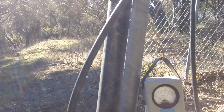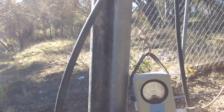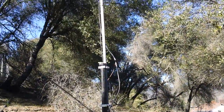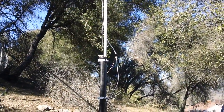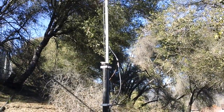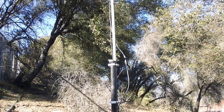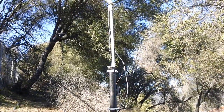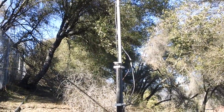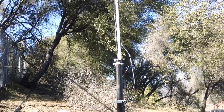The rule of thumb is: get the biggest, best cable you can with the shortest distance you feel comfortable running. I'm comfortable with this setup right here. Those losses I just showed you — from five watts down to three watts — that ratio applies to even higher wattages. So if you've got 50 watts pumped into this, you're going to lose 18 to 20 watts out of your transmitter. It's a ratio thing, and it translates to higher wattages: at 500 watts, you'd lose about 200 watts.